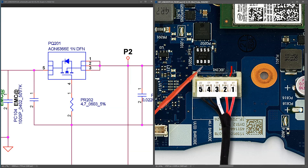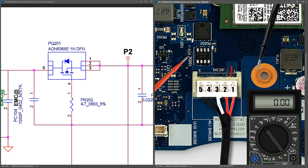The question is: are we getting the correct gate signal to switch this MOSFET on and allow our 20.50 volts from the drain through to the source? I place my black probe to ground and my red probe to the gate pin. It didn't change from zero volts — I'm getting zero volts at the gate pin. That's not the correct signal; we should be getting about 24 to 24.5 volts in order for that MOSFET to be switched on.